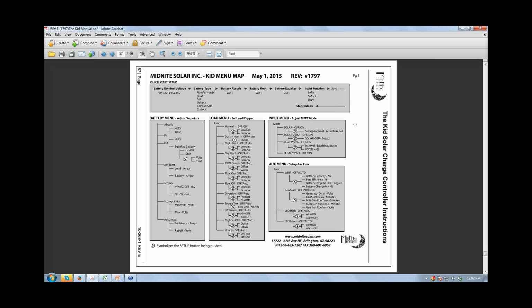Basically, the positive side for the load will have a fuse. You can just flip it like a switch, and the fuse disconnects, so you disconnect the load. The same goes for the battery banks. They would also have one. And I believe even the solar panels have one too, right? Sometimes, when we're just testing the operation, we want to disconnect the load and just let the batteries and the solar arrays do their thing, so we can see it charge, see the solar panels in action.